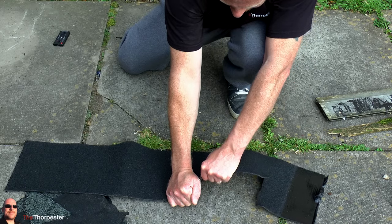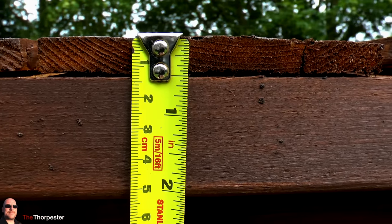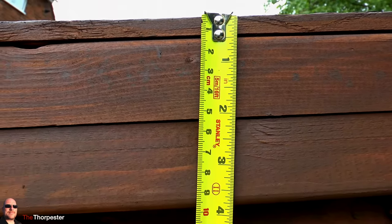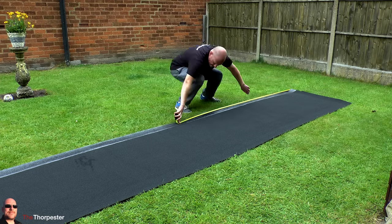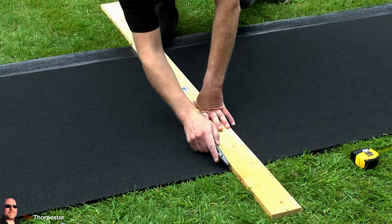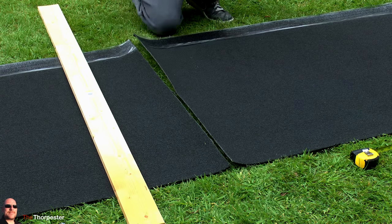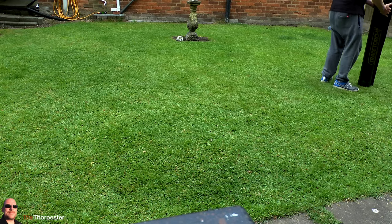The reason for the overhang on the roof is that down the sides of the shed there is wood about four and a half to five centimeters deep, so if I go six centimeters on the felt I'll be covering the wood and the water will drip off without touching it. On the front and back it's about nine and a half to ten centimeters, so ten or eleven centimeters overhang should be fine. I'm going to roll out the first roll on the grass and measure out my first length. Cutting is very simple — you can use a regular Stanley blade or a hooked knife. Once you've cut your first length just roll it back up and pop it on the roof ready to be laid out.